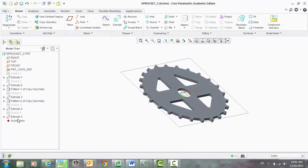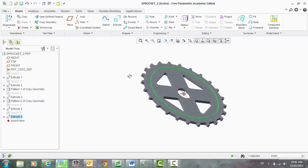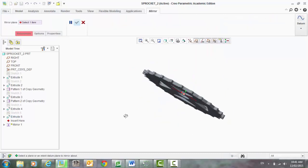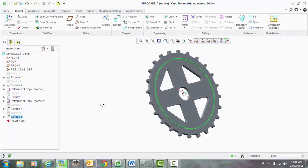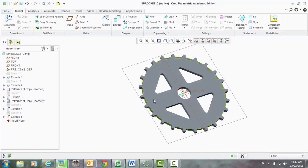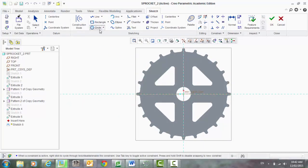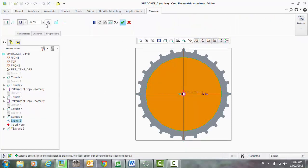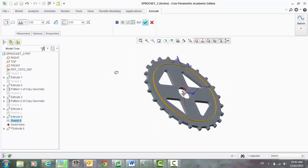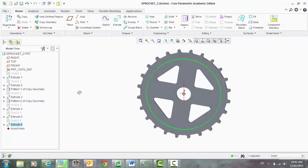You can do the same to the back. I'll accept that. Now on this side, if we want to, we can get this extrusion and mirror that. We can't mirror that how it is, so I'll remove that. You can just copy that same feature and sketch onto that other side. Sketch, circle, and our dimension was 260. Accept that. Extrude, thicken sketch, 3mm and 2mm. And that's the sprocket.